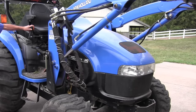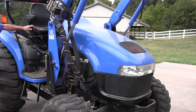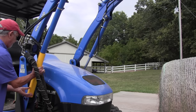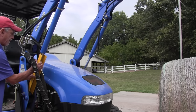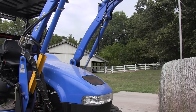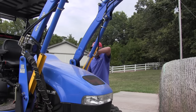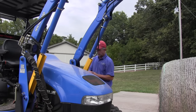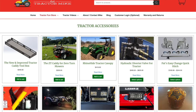I'm going to lift the loader up in the air and put these cylinder safety stops in. If you can get the loader up out of the way it makes servicing the tractor a lot easier. Put these stops in anytime you're working on the top end of the tractor, and get that loader out of the way — it just makes the job a lot easier. I sell these on my website; they come in 15, 17, and 20 inch lengths.